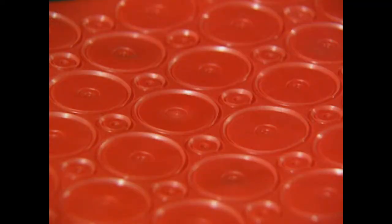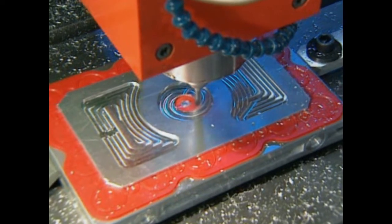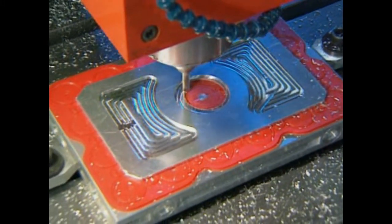To demonstrate the action of the lipped edge suckers, a plate of glass is placed over the VAC mat. When the vacuum is applied, the lips deflect outwardly, pulling down the component — or in this case a plate of glass. When the vacuum supply is removed, the lips reform. The VAC mat's unique design enables components to be machined through without losing vacuum hold down. No other system offers this.